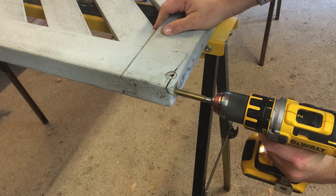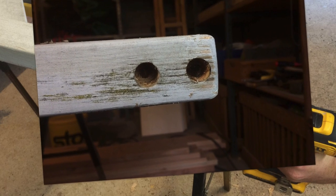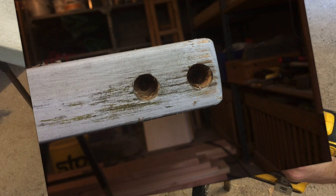I first used a cheap and old Forstner bit to drill out those plugs — cheap and old because I didn't have an idea how far in the screws were, so it was almost inevitable that I'd drill into the screw heads, and I didn't want to ruin a good Forstner bit with that. This process revealed the screw heads. You can't see them very well here, but there they are, and I tried the screwdriver — but of course the screws are very corroded at this point. There was no way of getting them out with a screwdriver.